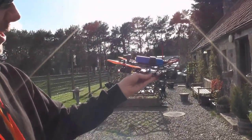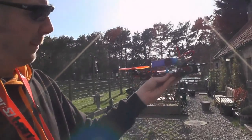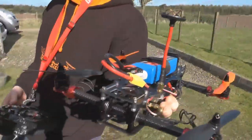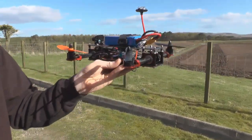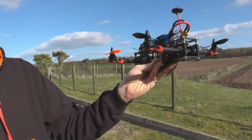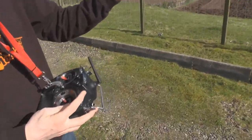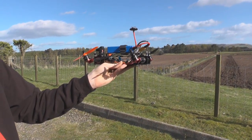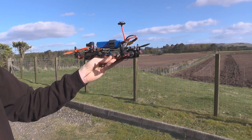You can also fly in rate mode - where it doesn't auto level. A lot of FPV flying uses rate mode, but then you kind of think, well what's the point in having a tilt mode if you're just going to fly in rate mode? Lots of people like tilt in rate mode but it wouldn't work right. What I've devised is another switch where you can have two different amounts of tilt on rate mode or normal quad mode, and in tilt mode you can have it fully tilted or just tilted a little bit.